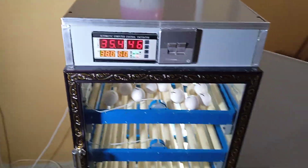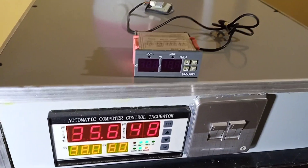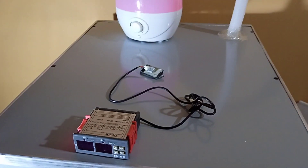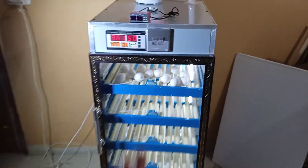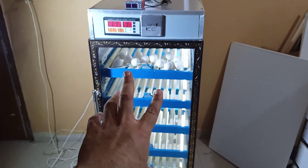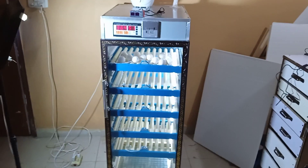Press the down button to turn off the alarm. I have a plan to place an STC 3028 for the emergency setting. We can also use an inverter or UPS system because it is using only 200 watts — you would need a bigger battery for that method. I'm currently using only 200 watts; otherwise you would need 1000 watts to maintain heat in a big incubator.